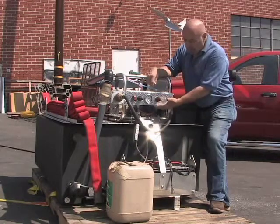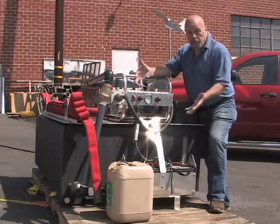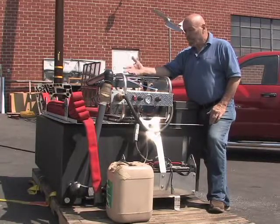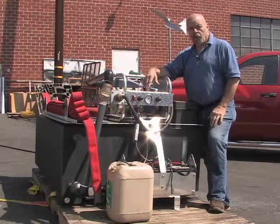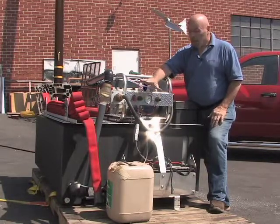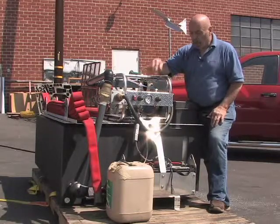This one's the air. This doesn't have a tube going to anything because it pulls it out of the atmosphere. As you open this up, it allows more air in — that's how you get your cap. It's soap, air, and water, and a combination of all of those. You can mix this in any ratio you want. Once you get it the way you want, don't touch it again — just leave it alone or mark the colors.